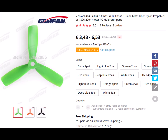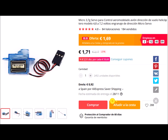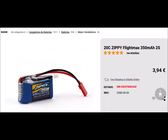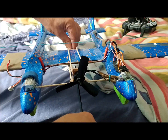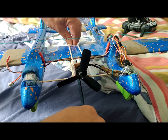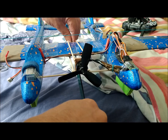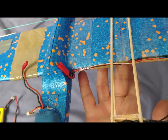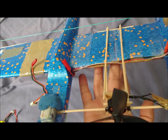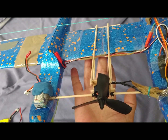The ESC is 12 amps. The servos are 3.7 grams. The largest battery we can place is one of 350 milliamp-hours and 21 grams of weight. This battery approximately compensates for the symmetrical weight of the ESC and receiver. If we add a larger and heavier battery, we have to compensate for the extra weight in the fuselage on the left by adding dead weights in the fuselage on the right. We avoid adding dead weights that decrease the aerodynamic capabilities of the plane.